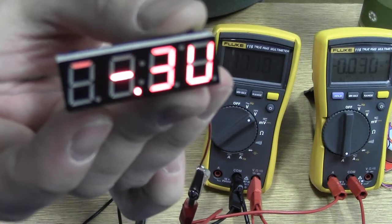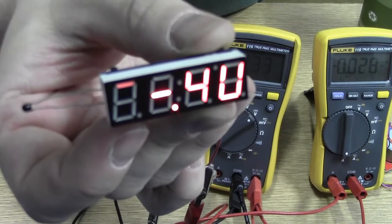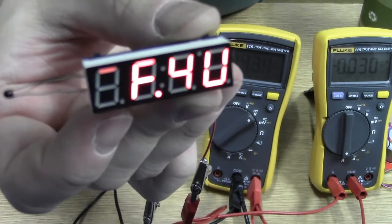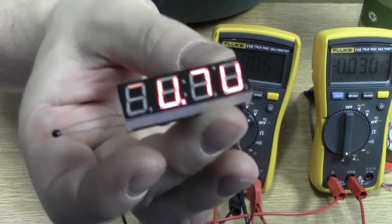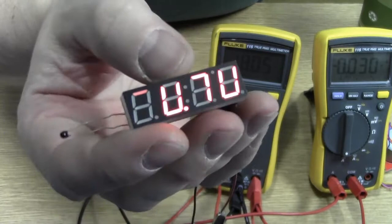And that, as I'm increasing... Oh, there we go. 12.3. It's minus 0.4 volts, apparently. Going up, and up and up and up. All right. Just coming up to 18 volts, roughly. Yeah, 18 volts. No, that voltage function is definitely shot. That's no good. That's a big fail.